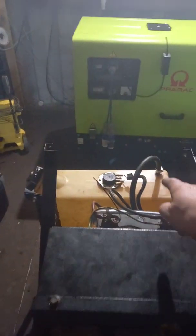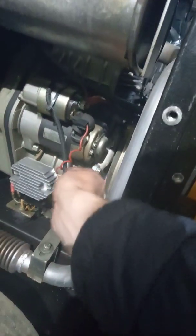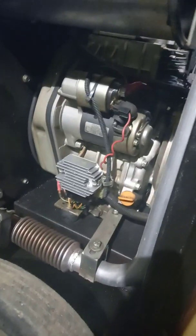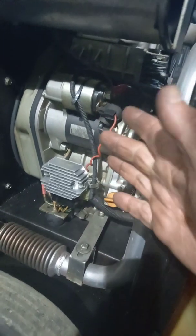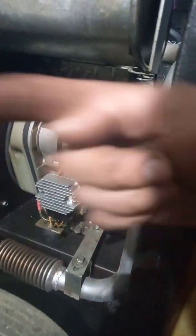So the thing to do is get the lid off, get the panel off the back, and then check the 20 amp fuse. Now this is a secondhand unit — it actually doesn't have a 20 amp fuse in the line that goes up to the top. But in the newer units, the one to my left, that has a 20 amp fuse going in there. So they can blow, and if they do, it's a simple operation of changing the fuse over.